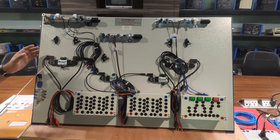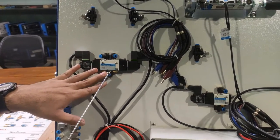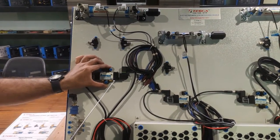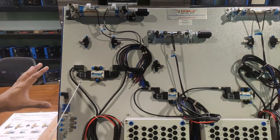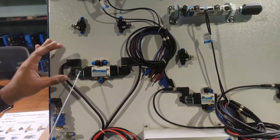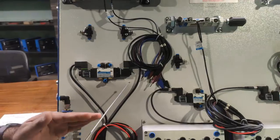The actuators for these cylinders are solenoid valves. These are double-coil solenoid valves — 5/2 solenoid valves. There is one inlet (input line), two output lines A and B, and two exhaust lines — five lines total, hence the name 5/2. The actuation is operated by a 24V DC solenoid coil. When one coil is operated, forward movement occurs; when the other coil is operated, the reverse movement occurs.